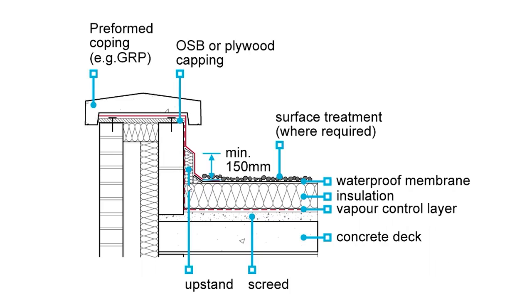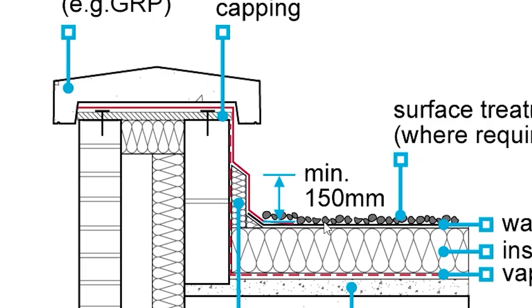To my mind it's not brilliant. What I would rather see — this brickwork here and insulation there is all fine — is that insulation carried all the way through to meet that insulation there. Because what do we need here? We only need a minimal amount of brickwork just to support that coping stone and give the wall a little bit of stability. You can see what they've done is put a bit of plywood or OSB through here as a fixing, which allows the wall to be tied together.